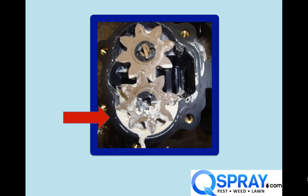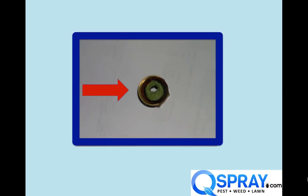Here's a pump that was just totally clogged up. You're going to break something if you let it get this clogged — you've got to clean out your equipment. Here's a fitting that was just totally starting to clog with chemical. I don't know if this is fertilizer or a pre-emergent with a dye in it, but I call this the McDonald's photo — this is my arteries after eating cheeseburgers from McDonald's for a couple of years. Think about how much harder your pump has to work sucking through this kind of fitting.